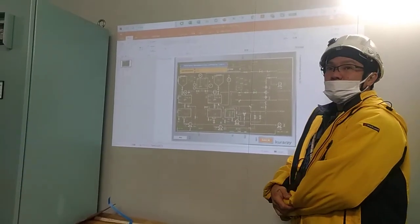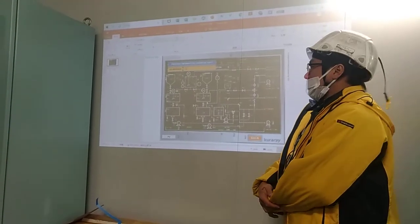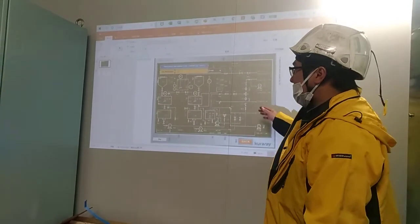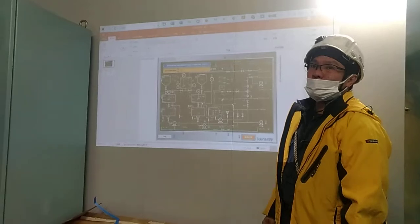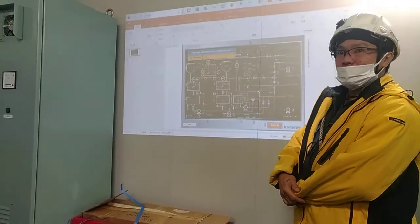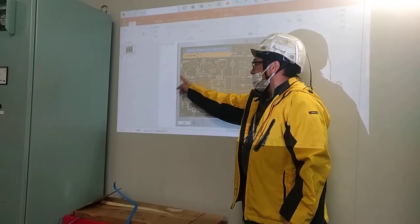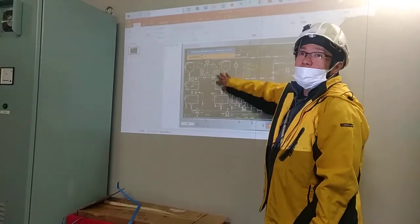Okay. Recirculation for the neutralizer or no? No. Just don't turn on the system, because if you turn on the system, the chemical will plug up. If you have maintenance, or if there's some problem, that's when you need to throw the neutralizer. You also have the manual valve there to open to throw the remaining chemical inside. As per your experience, there's no possibility that this neutralizer solution will go back to powder form. As we know from the other owner, there's no problem with the neutralizer. The problem here is in the disinfectant.